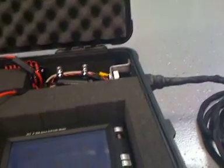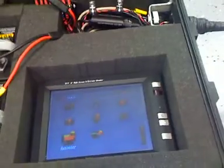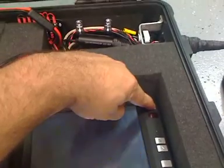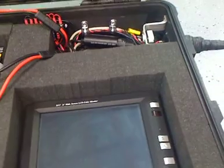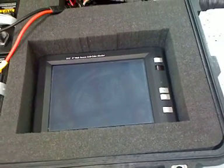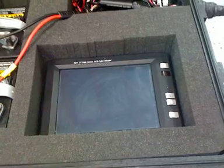Close the laptop. This note should be made: when you're recording in the field, turn off your monitor. The monitor actually takes up more juice than the camera and the DVR combined, so leaving it on would be a big no-no because it would considerably reduce the amount of available power you're going to get from the batteries.